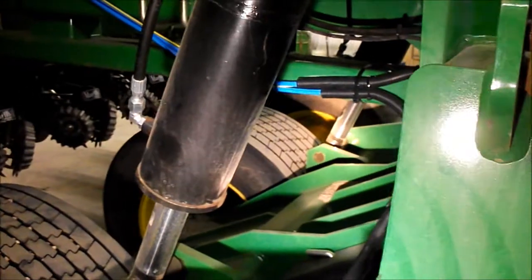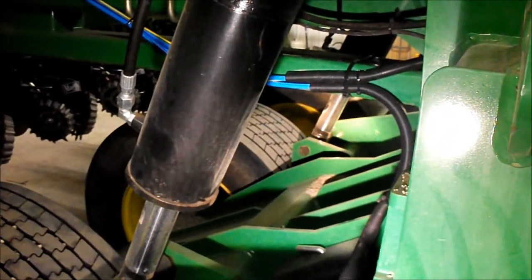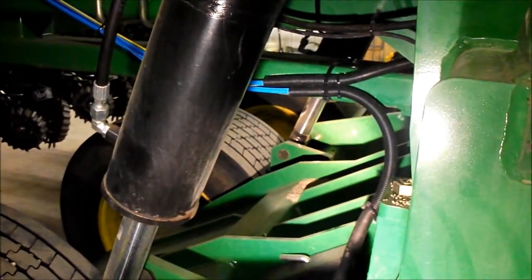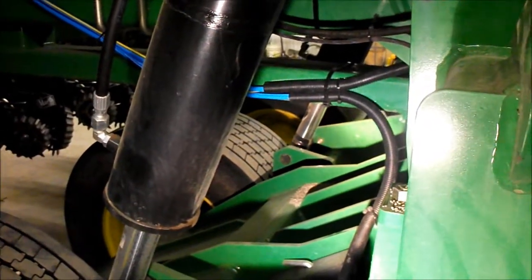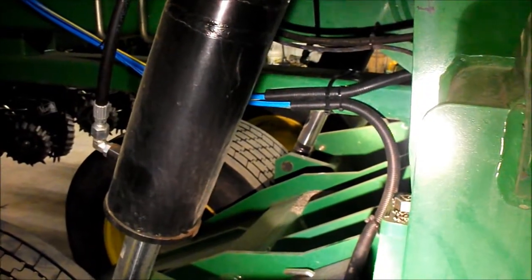Here's where the airline from the left hand side comes across and the conduit ends. Get that measured out, then you can lay your airline on the floor, the conduit on the floor, run your 12 and your 4mm blue airlines through it on the floor with straight, and pull probably 8 feet extra airline through that conduit when you're all said and done.